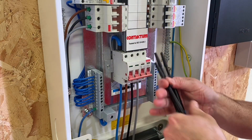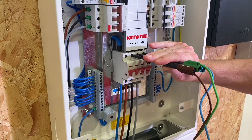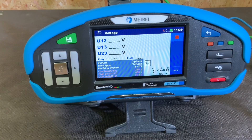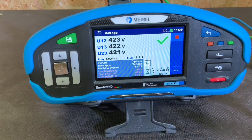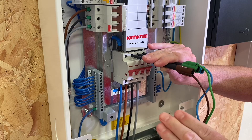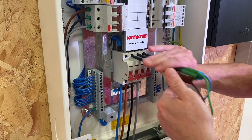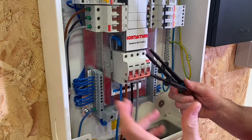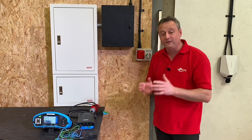We probe back in as before, but this time not in the correct sequence. We hold in position, energize, then press the run button and answer the question. You can see we've now got three, two, one — not the one, two, three we had before. That's your incorrect phase rotation. Top tip: check your probes are correct first before wondering whether the supply cable or a joint in the road is incorrect, because incorrect probing can show incorrect phase rotation when that isn't actually the case.